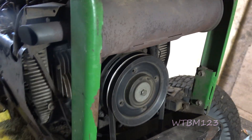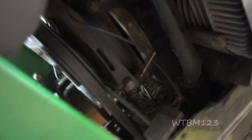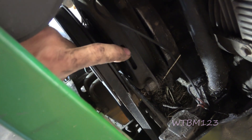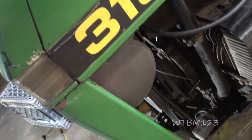Okay, now for the PTO clutch. Look right here, there's a slot coming in from the bottom down here. And that's probably something like this one. Back in there is a gap you can stick a feeler gauge into and check the gap on these clutches.